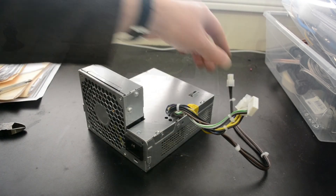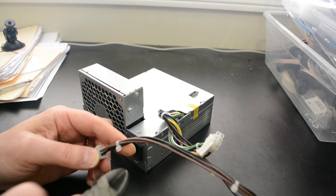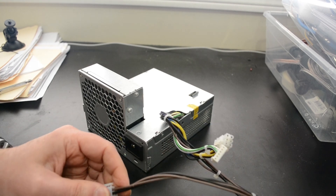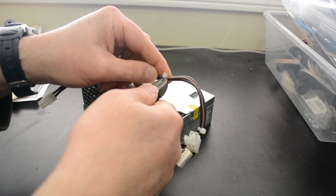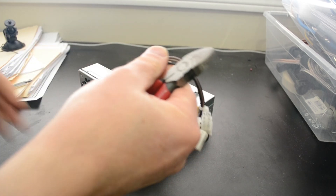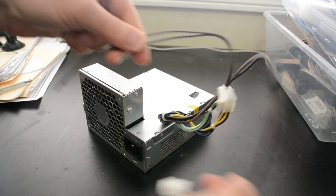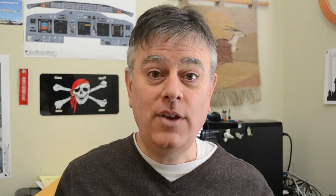And that's it — you're all set to use it. What about your 12 volts? Simple. Take the little four-pin connector, and it's probably a good idea to take off the wire ties holding these wires. Cut free one of the brown and one of the black wires. Black wire is ground, brown wire is 12 volts. Easy. You can use one of these power supplies to provide 12 volts to any of your projects. It works great — I've already tested it on a wiper motor and you couldn't tell the difference between that one and the other kind of power supply as far as speed, power, and torque go. They're working pretty much identically.